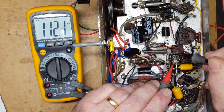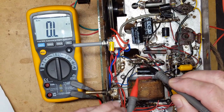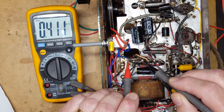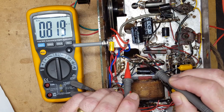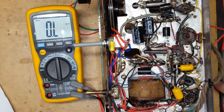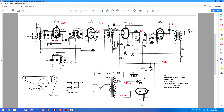That's interesting - if that first one is low, coming in at just 0.4 of a meg instead of a meg, that's going to drop the bias down, making it closer to ground. I think that's worth changing, and the other one too I suppose.